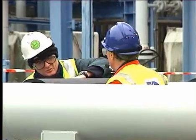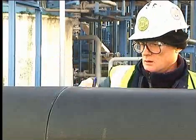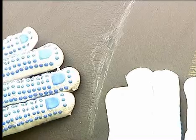Always ensure that the Armaflex sheet fabrications are fitted under compression and no gaps are present on any butt joints prior to completing the wet sealing in the seams.